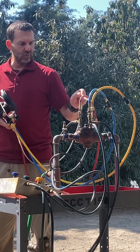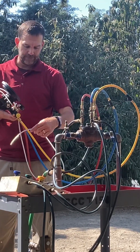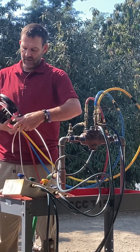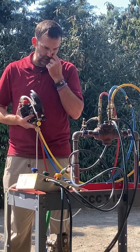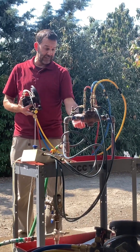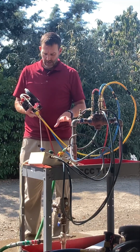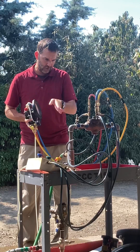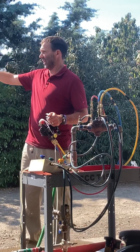Now I'm going to take this red water and launch it through the yellow hose and back pressure the number two check. Opening up the bypass of the vent valve, my choices are tight, decompression — for that to occur the gauge would fall and water would spit out — or it's leaking. Water is not leaking, so it's not leaking. As it stands, this is stable. The gauge is stable, no water is coming out. Therefore, check two is marked as tight.